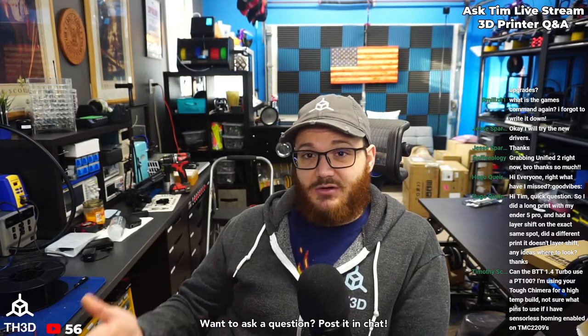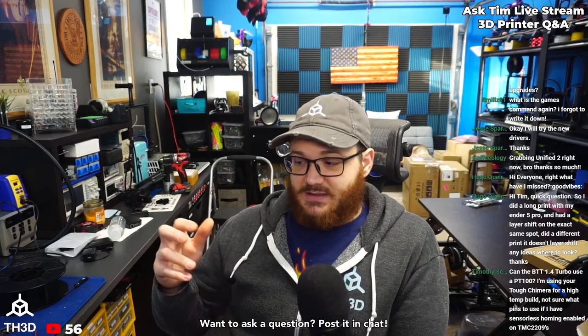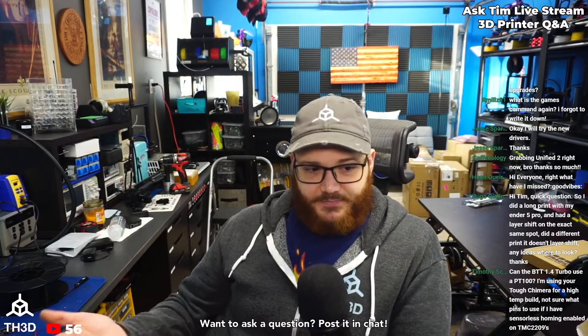Now, that's just to get your initial one. I still would highly recommend that when you start your first print after setting it, be ready to baby step it. So check, because that'll get you close, but it's not always going to get you bang on. You can use it if you want. We put it in there because I thought it was a neat feature. So I would recommend giving that a try and seeing how it is. Otherwise, just follow our normal installation for setting the Z offset like you would on any other machine.